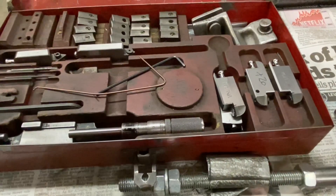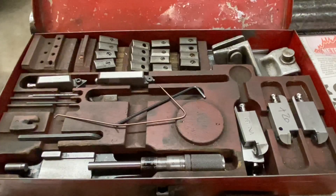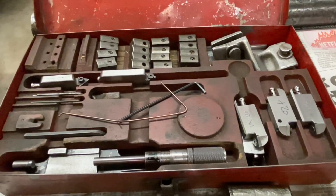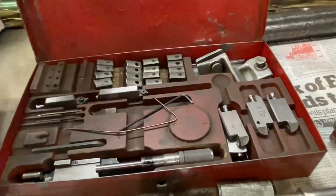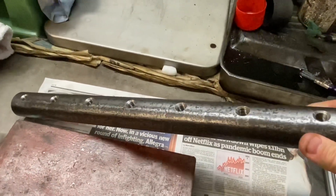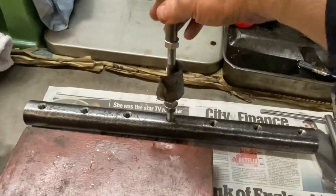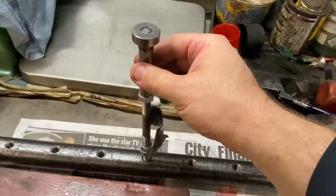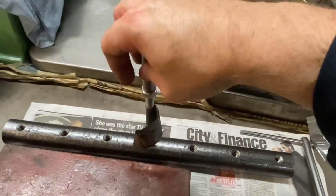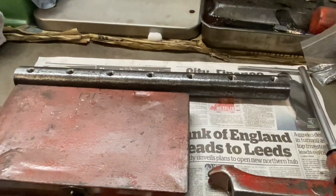A couple of other things I've done: the original bore clamps which hold the machine into the engine were basically marginal at best. I was advised by people who use these machines to replace them. So what I did is replace the bore clamps. I now use a main bearing bar which goes along the main bearings under the block, and then uses studding which screws in and goes up the cylinder, allowing the foot of the machine to clamp to the block and pull itself onto it — producing a very strong and reliable mount. When you're offset boring and you've got quite a load on one side of the machine, it's nice and stable.